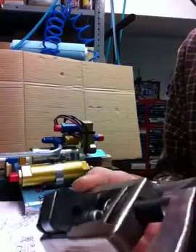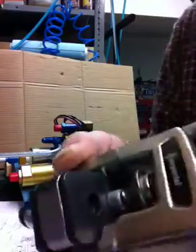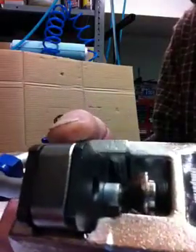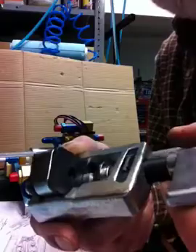Take our flaring device. Draw it over the tube so the cone goes into the tube. Put a little dab of oil on it to help lubricate the flare. And we'll turn this in — I find 7 times makes about the right size flare.